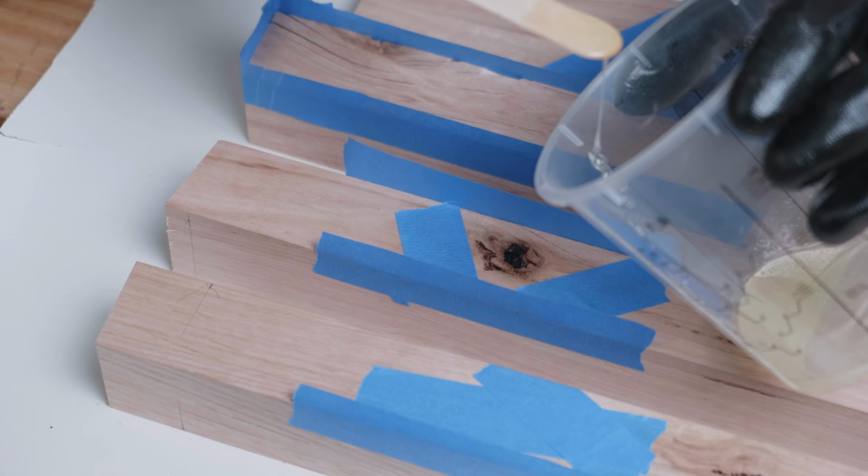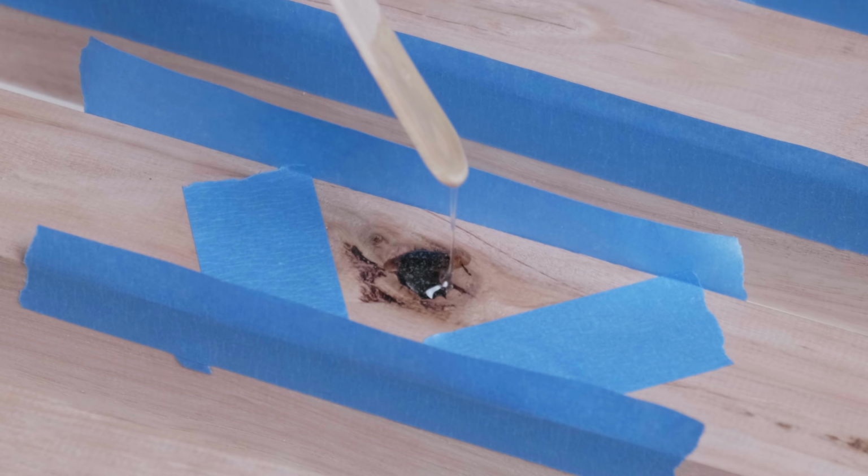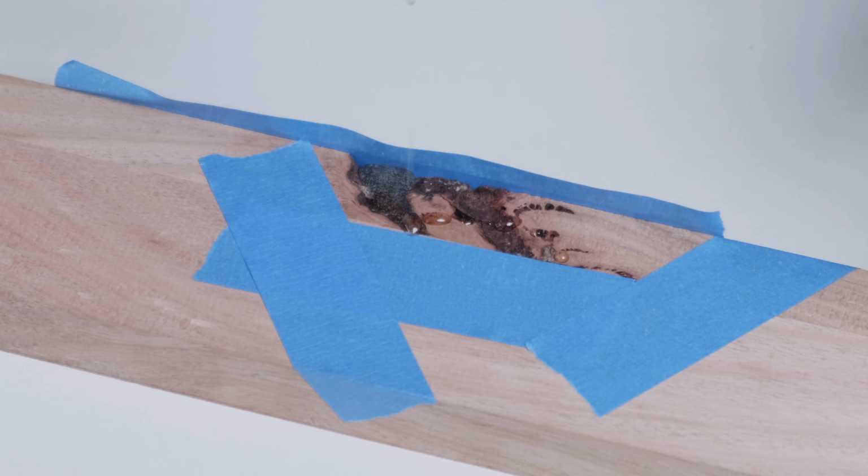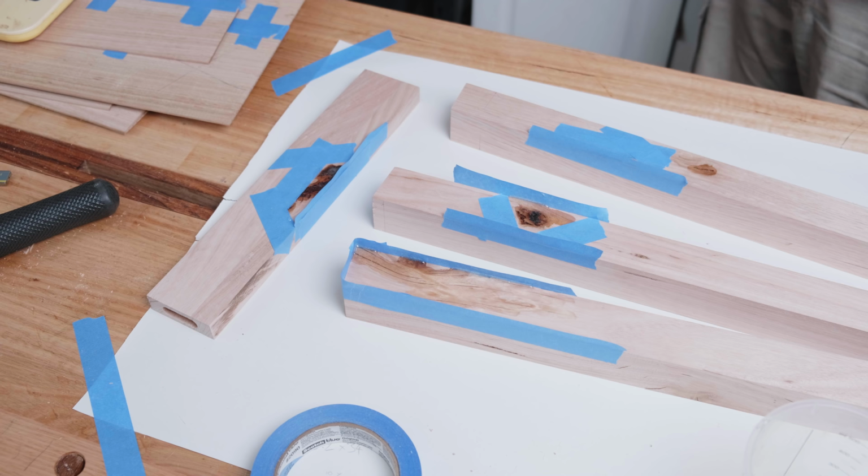As this is all reject wood that's been reused, I had to deal with some of the, let's call it, bonus character to the wood, by filling it with epoxy. A torch helps pop all the bubbles in the epoxy before it sets, but make sure to let it run a bit first to avoid flare-ups.